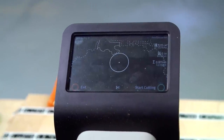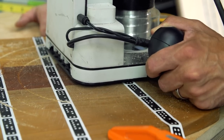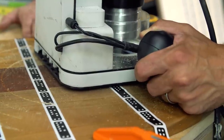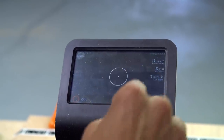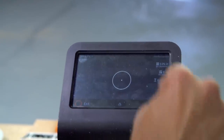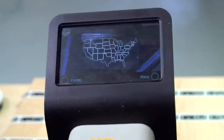Good question. So if you're familiar with CNC, you kind of have to erase everything you've ever learned. From a very beginning level, the whole goal of this thing is to not require expert knowledge to use a tool. The way we think about tools at Shaper is that we enjoy the versatility and the intuition of using a tool. When you pick up a drill, you kind of understand what you do with the drill — we want the same thing applied to this handheld CNC. Everything can be done within the touchscreen interface. You can select: I've got a quarter inch cutter, I'm going to cut to this depth, and input that directly to the screen. You're letting the system know what cutter you're using, how deep you want it to cut. And then once you have it overlaid, it's as simple as pushing a button.